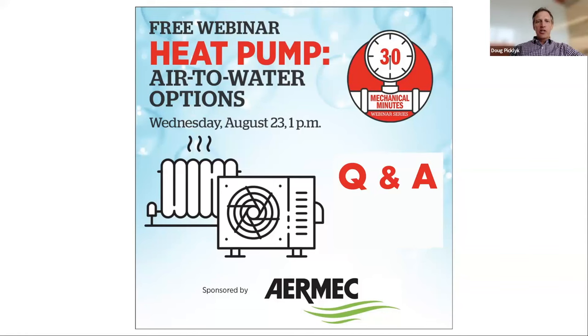Q: Do air-to-water heat pumps work efficiently for cooling — i.e., chilled water to cooling coils? Absolutely. They can produce 40°F water if you want it, though designing around 50°F chilled water temperature gives better performance. As chilled water temperature requirement goes down, so does cooling capacity and EER. Chilled fluid at 45–50°F is very useful in cooling coils — it can provide good dehumidification and sensible cooling as well. Air-to-water is excellent for cooling.